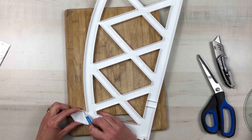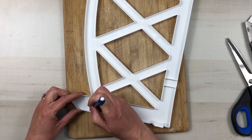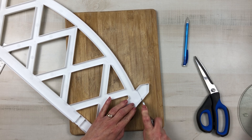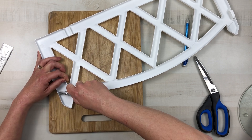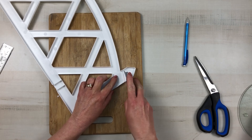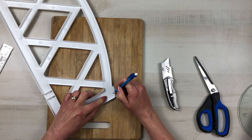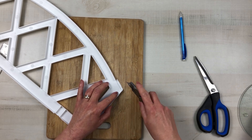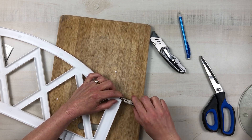For that top part I want to remove — this is the back part of the fence — I'm going to draw a line a little bit higher than the actual top of that curve because if I cut at the line I drew on the front it was going to give me a gap at that top rim. So I'm going to take my utility knife on the back side and cut that down until I'm able to remove that top portion. Then I'll take my pencil and draw the line where I need to fold it over, take my utility knife and score it, and then use my pliers to bend that over so it'll have that top piece just like the other part of the arch.